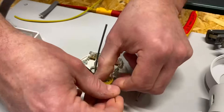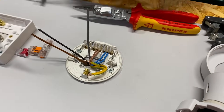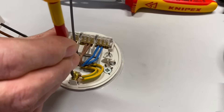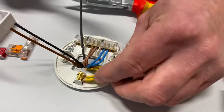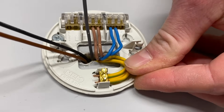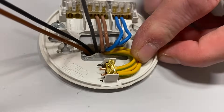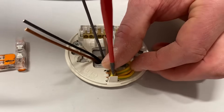I did say in a previous video that this is one of the few times I actually don't double over my terminations — anyone who's followed me for a long time will know I'm a big fan of doubling over connections. I can use either of the terminations to make my life easier. Let's pop our CPCs in — hopefully you can see the conductors come through. I'll give them a tug and tighten those up. It doesn't matter if a little bit of copper comes through too far; it is the protective conductor. Just make sure they're secure and tighten that one up.